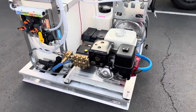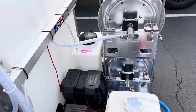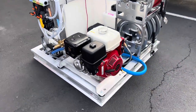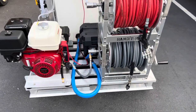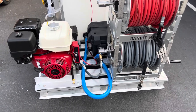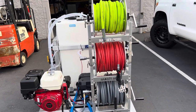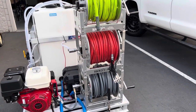This is 48 inches by 48 inches. You've got the battery back in there and a seven-gallon soap tank. All the soap tanks are plumbed with strainers and drop tubes — weights that hold them into the tank so they're not floating to the top. There's a one-inch drain hose that curls around and can be used as an eyewash station, hand wash station, bucket filler, or for emptying the tanks. Full-frame aluminum bandit reels with stainless steel manifolds.